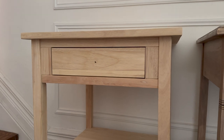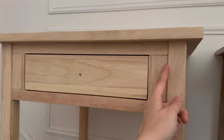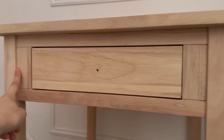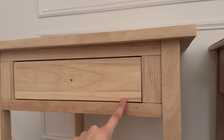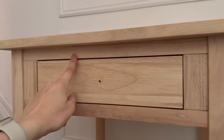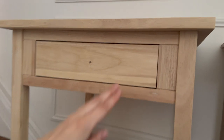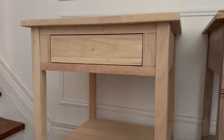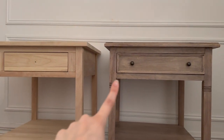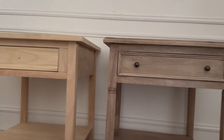Now that the table is built, we're going to cut out the pieces for the front. The inspo image had the drawer front coming over to the legs, but this one stops short. We're going to measure from here to here and here to here, then cut another piece for the height — same with up above. Double-check all your measurements and don't assume they're the same width all the way up. You can see the front extends on the comparison — that's the part we're working on, and after that's cut we'll work on the trim.